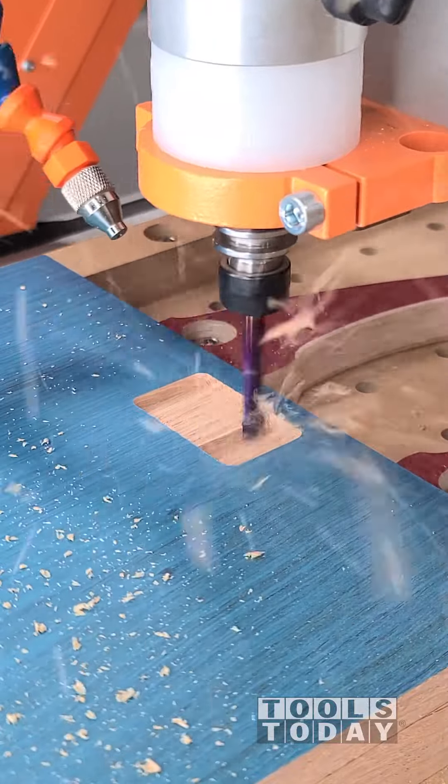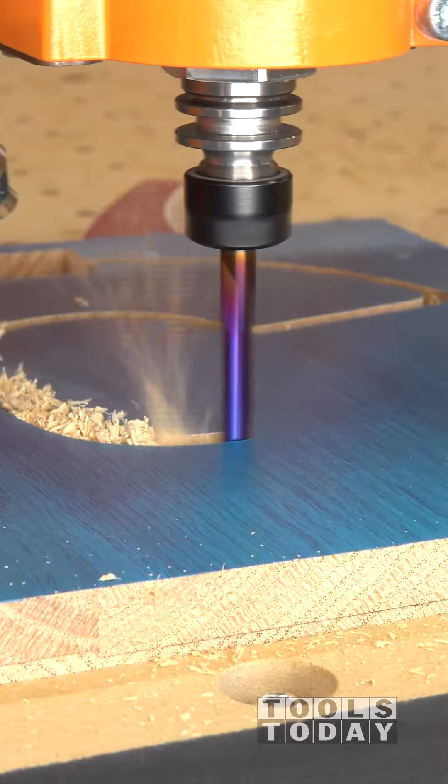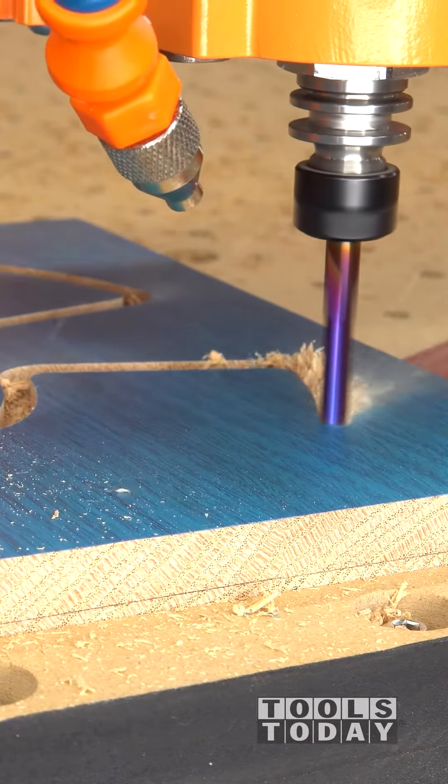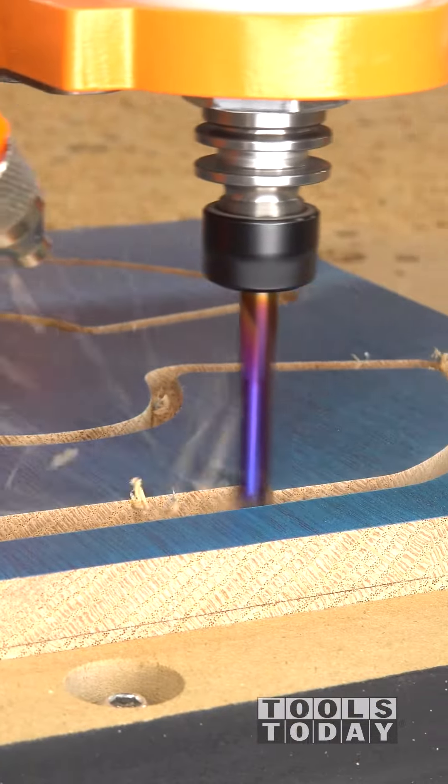Using the 46415-K quarter inch down cut bit to go through here and do all of the cutting. First we cut a coin slot into the wood blank, and then we're going to cut the profile for where the acrylic will fit in later on.